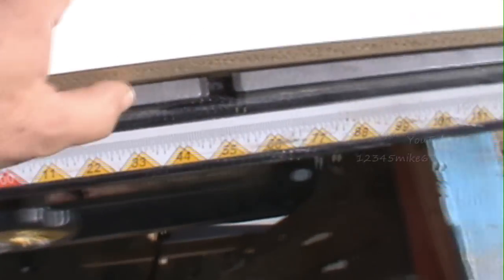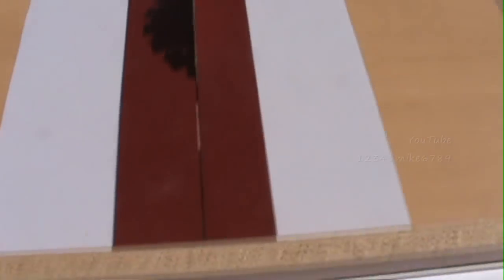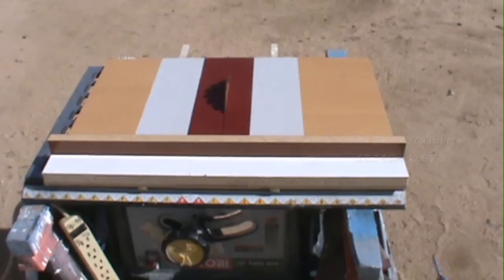Okay, so what I'm going to do is just take a chance. I'm going to flush this out with our jig. I'm going to screw it with the 3/4 inch screws, and place this here afterward and double check to see how square I am. From there, if I need to adjust it, I'll just simply back the screw out a little bit, smack it over a tad, and tighten it until it's good. Okay, that took a second. I didn't screw it completely off. I'll screw it off once I make any final adjustments.